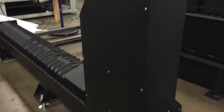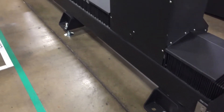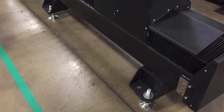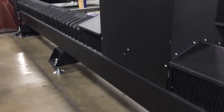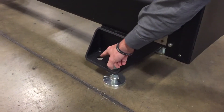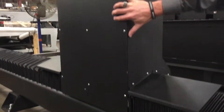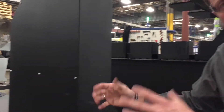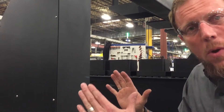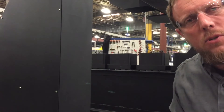With these big 6000 series machines, it's really important that you get the entire system square and level. All of these components are machined perfectly perpendicular and parallel on our big multi-million dollar CNC equipment. Once it's installed, you're able to take your leveling feet, level it, and attach it to the floor so it's solid and secure. The design of the system will actually self-square, so every time you home the machine it finds its new square. That's super critical for the accuracy of your parts.